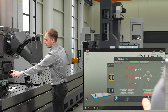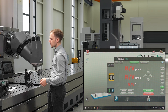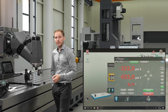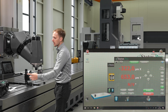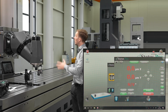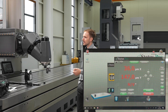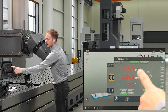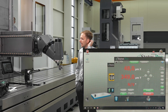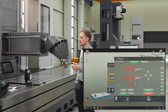We see the laser is already connected to the detector — I press once on its symbol. Now we see the values of the detector. We are very near to the laser, so we set the values to zero by pressing zero. Then my colleague drives the axis to a far position and we can see in the fine adjustment the misalignment of the laser. We see an X and a Y value; the laser is currently leveled, so the Y value is the misalignment of the machine to the horizontal.